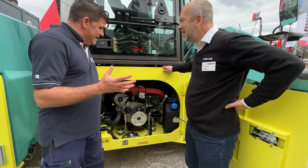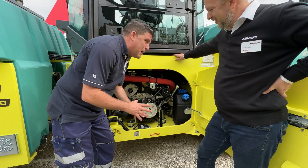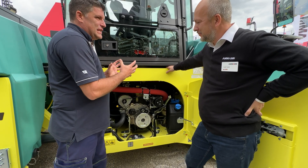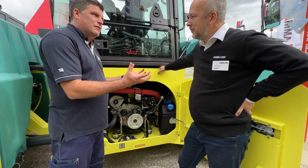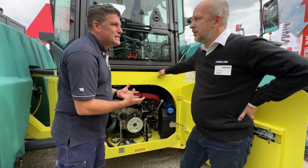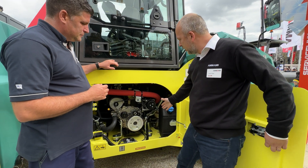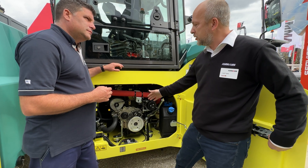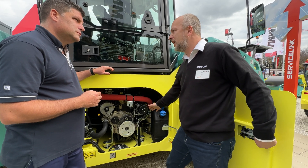Which is pretty hefty stuff, and of course I noticed the mountings — this machine is vibrating a lot, so that's never going to be good if the engine is mounted directly. You need to get the right sorts of mountings and test that out so that the engine is in a calmer environment. Definitely — the rubber mounts are there for a good reason, because they protect the engine from the vibration of the machine, and the machine frame from the vibration of the engine.